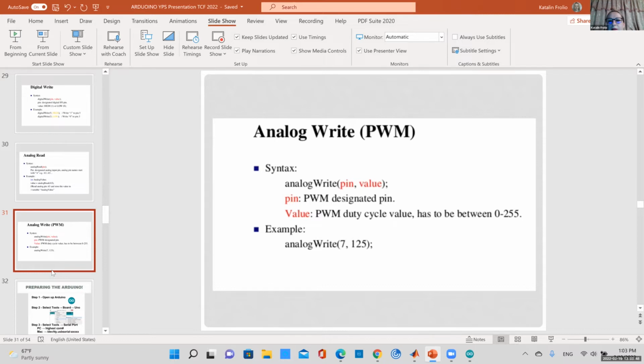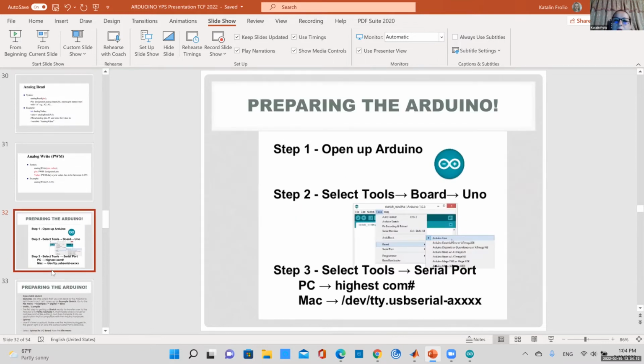And you can actually do pulse width modulation. So analog write takes as input a pin and a value. So you can vary the value between 0 and 255. So actually, in this case, you would give something between 0 and 5. It kind of looks like it's an analog value, even though it's not really. We're going to talk about pulse width modulation because your computer is only capable of doing zeros and ones, 0 or 5.